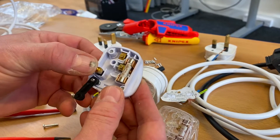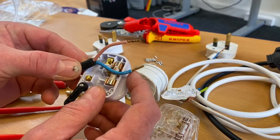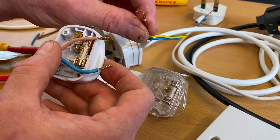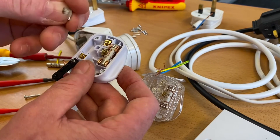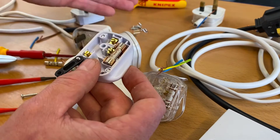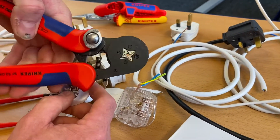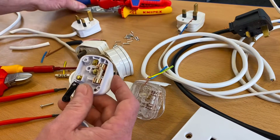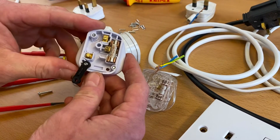In reality, in the real world, in this style of plug top I'm probably going to want students to double the conductors over. When you strip it apart you'd see slightly longer conductors with a tube over the top - not the fine stranded class 5 conductor, but effectively a solid tube called a ferrule. We've got some ferrules here - a little tube that goes over the conductors to make them more of a solid conductor. You use a ferrule crimping tool to do that.